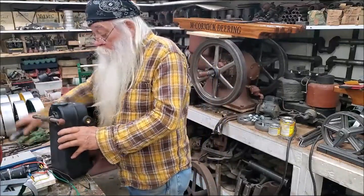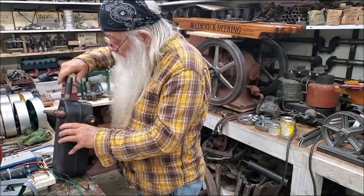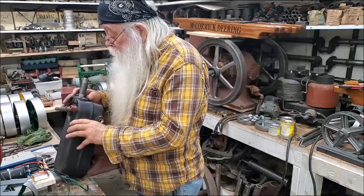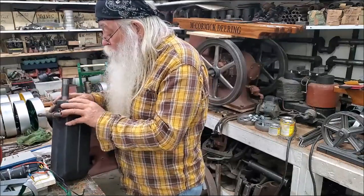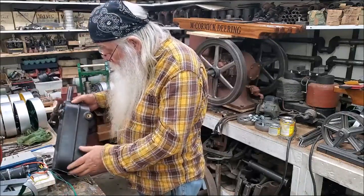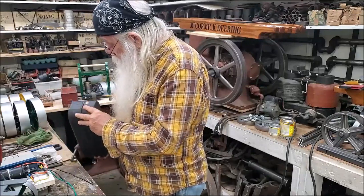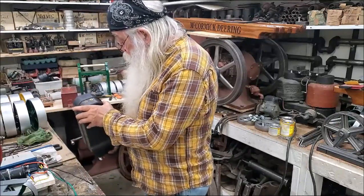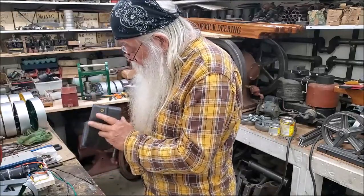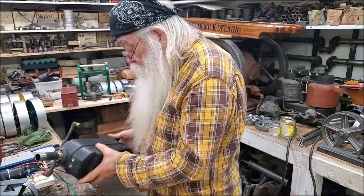Look at it — it goes in the front. The construction is — they did a little second operation there with a grinder to clean up that flash. Good job, I think. It's a little porous right there, I can see some dryness. But I think it's good. It has brass embedded in it, front and rear. The fittings are quarter-twenty.